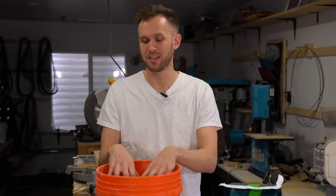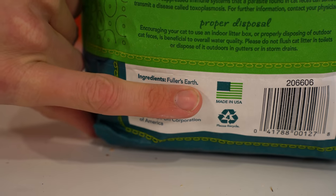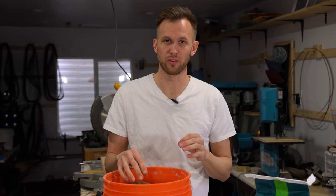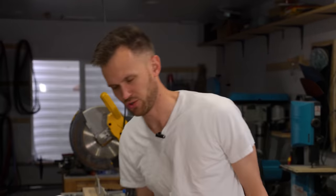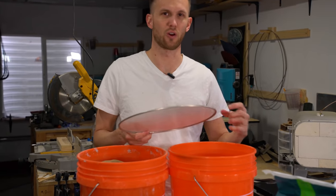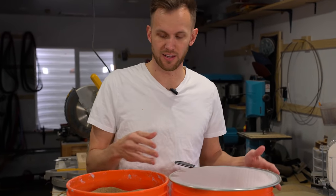With the box built, it's time to move on to making our green sand, and we've got three ingredients for that. The first is sand, the second is kitty litter — specifically a kitty litter made of fuller's earth — and then some water. With the sand and the fuller's earth, we want to make sure that we're using only the finest grains. So we're going to filter them, and in the case of the kitty litter, use a blender. I tried to get a good sieve at the store, but all the ones I could find had too large a mesh. So I got this oil splatter guard, which is a metal mesh — it's finer than any of the sieves they had. So now I just need to start putting sand through the sieve into this other bucket.